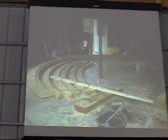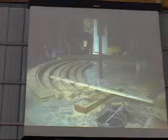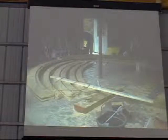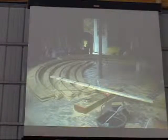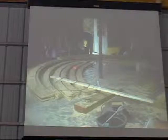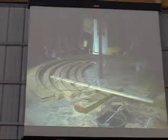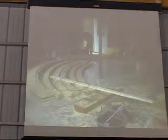Here are the panels — notice how evenly cut they are. If you use that pivot method and a good router, and make sure the bits stay nice and sharp, you can make a nice smooth cut. Take the 4x8 fiberglass panel and screw it into heavy wood so it doesn't shift. If it shifts, you'll end up throwing that piece away — it's got to stay rigid when you're cutting it. The side panels are half-inch and doubled because they have to hold a lap joint. The central arches are four layers — three layers for strength and a fourth smaller layer so the fiberglass can lay on top.